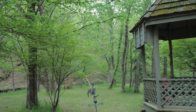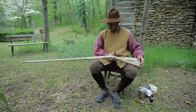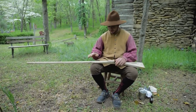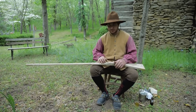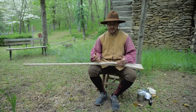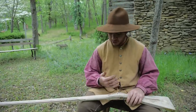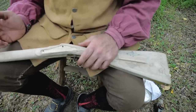We're about to stain and finish this stock — we've got it relief carved and cleaned up. I raised the grain four times. Basically you want to keep raising the grain with water — just get a bucket of water, dip your fingers in it, and rub it on the stock. Let it dry about 20 minutes, then the stock will feel rough again from the little fibers raising back up. Use sandpaper, scrapers, or whatever you have and smooth it back up, then keep raising the grain over and over until it remains smooth.